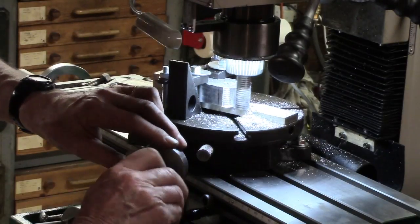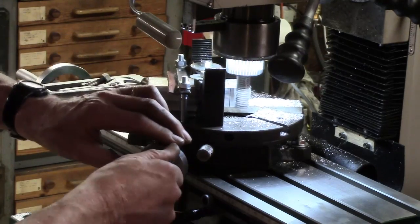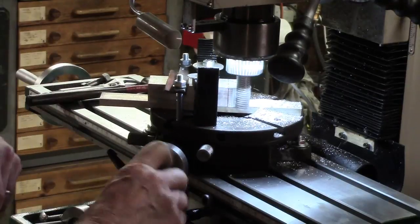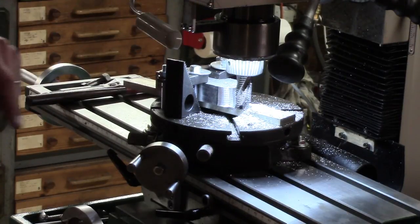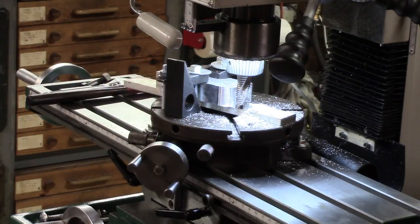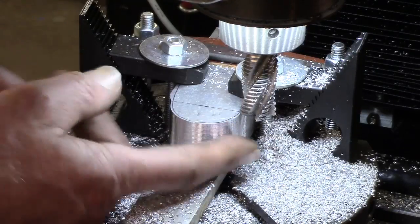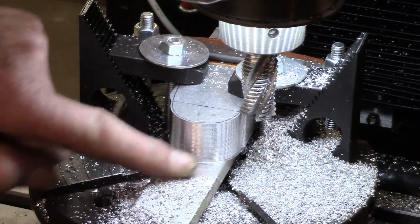Let's try again. It's tedious, but we're getting a curve on it. I'll show you the finished result, because I'm reckoning to finish almost everything on this thing with filing and handwork, really — that's why I said earlier I want a CNC. Well, there you are, it's a sort of result. Obviously you've got marks because I was using the roughing end mill. It's actually followed fairly well, but there's a word for this setup — it's called a lash-up. It's an absolute lash-up.